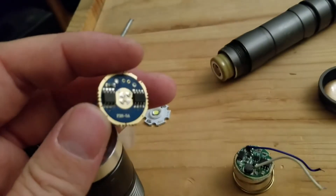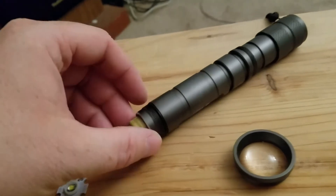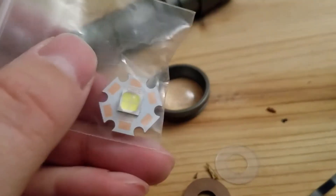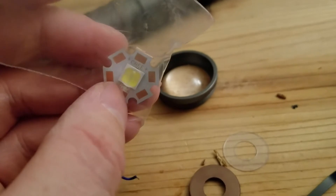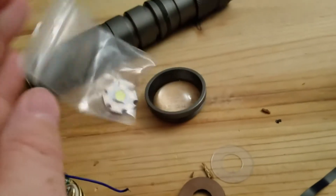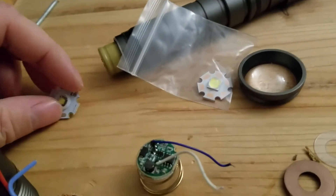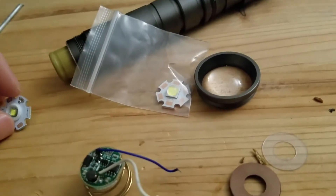The batteries I'm using are LGs that can put out 4.8 amps each, which is perfect for the LED I'm putting in. It's a 6-volt LED that'll take up to 8 volts and needs 4.8 amps to drive it. That works out to something like 4,080 lumens — completely insane and overkill. The original T6 is about 1,000 lumens, which is already overkill, but this is four times that.